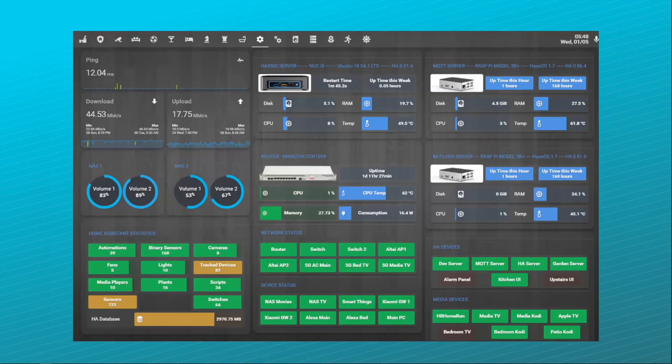One of the reasons that I like Home Assistant is I can take my ESP32 cameras and throw them in here and it will interface to them. Not only that, it can also throw in some AI software like TensorFlow, and I can use it so that it can use the cameras to identify things, which I can then use to control things around the house. For instance, if a human walks into a room, TensorFlow will determine it's a human and turn the lights on. I have two dogs. I don't need the lights being turned on when the dogs walk into the room. It's really not going to help them.